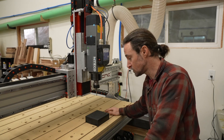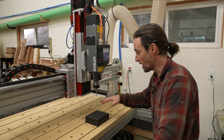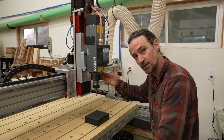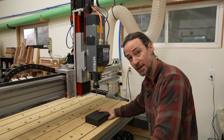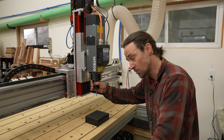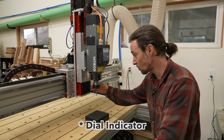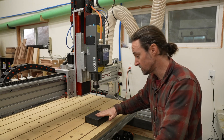There are two steps to tram the head on a CNC machine. The first step is to get our granite surface plate or piece of glass perfectly level with regards to one point on the machine — we'll do that by jogging the machine to three different points and leveling it. The second step is to rotate the dial test indicator around the spindle to get the spindle perfectly level with regards to that surface plate.